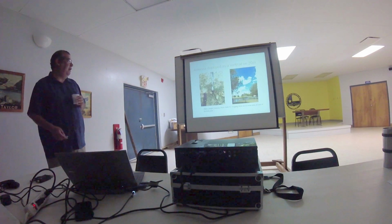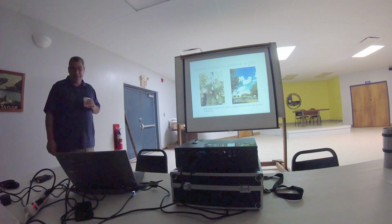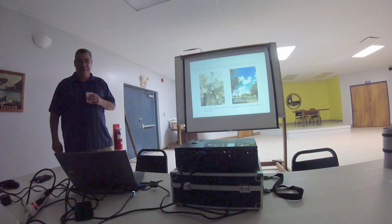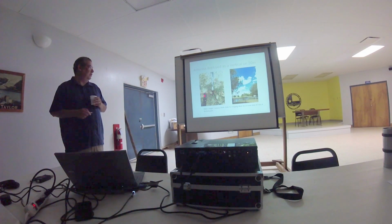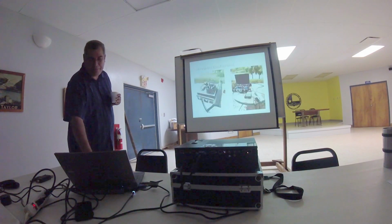This is just an example of how I deployed it. I've got a 30-foot travel mast that I basically lashed to a hurricane fence post. The wire goes up 30 feet, and my feed point, you can see, is right at the ground level. My counterpoise is sitting on the ground. I wrapped 6 or 7 turns for an air coil choke here. I haven't talked much about the common mode currents that happen on an end-fed, but you really need to choke your coax in here, or you could bring RF into your shack or up to your rig. That can be a problem with end-feds. So since I'm running portable, 6 or 7 turns of coax, just quickly wound on there, seems to do a pretty effective job of choking it off.